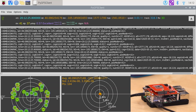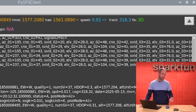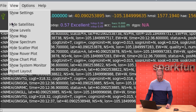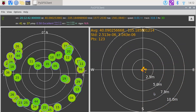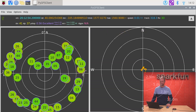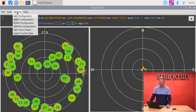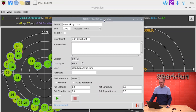We like it because it's got lots of bells and whistles, including a built-in N-Trip client. Right now we can see the NMEA scrolling by — we've got a 3D fix and we're seeing 41 satellites, which is kind of crazy. We're going to make the NMEA go away because we don't need to see that scrolling by. You can see those nice concentric circles — we're bouncing around one meter with our 3D fix. That's what you'd expect with an off-the-shelf higher-end receiver: about one meter of accuracy, or a thousand millimeters. We've got this pointing at our base station here at SparkFun — Boulder SparkFun 1.